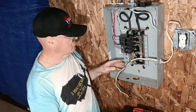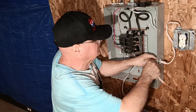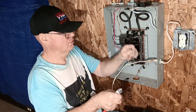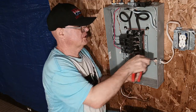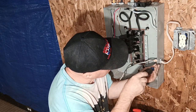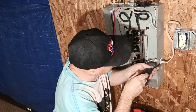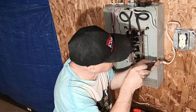Now we'll hook up our 120 volt circuit — rip our insulation back and clear out our debris. This would be a 15 or 20 amp circuit for lights and outlets. In the kitchen, number 12 wire is required because of appliances, but you're allowed to use 14 in a bedroom, living room, or hallway. The kitchen requires a minimum of two circuits with 12 AWG on 20 amps. We'll get our connector nice and tight.